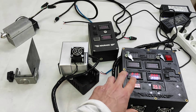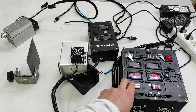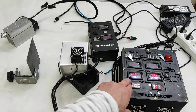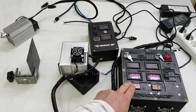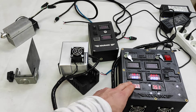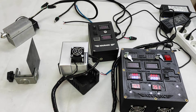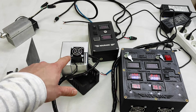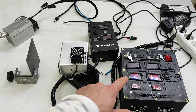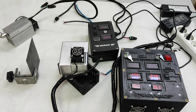The temperature will stabilize somewhere in the range of 18 to 20°C. Let me show you that it won't go below that. Then I'll turn on the laser and the system will also stabilize the temperature. Right now the temperature went below and that TEC cooler will be turned off, and the temperature will slightly go up before it turns back on.